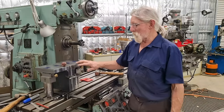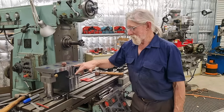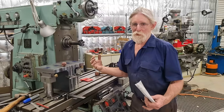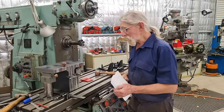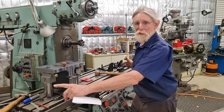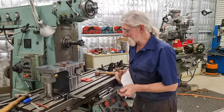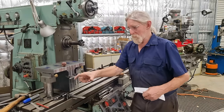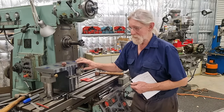And the second reason why I did not want to machine these in a braced condition is that this is 300 grade plate. When you machine it, more often than not, it's susceptible to stress movement. I machined a big long piece in here the other day. It was a meter long, flame cut both sides. This has been flame cut. It was 100 millimeters wide and 32 mil thick plate, same as this.